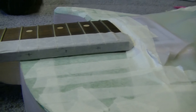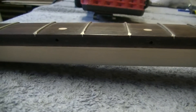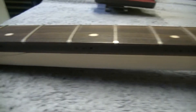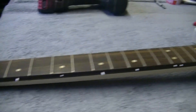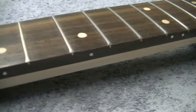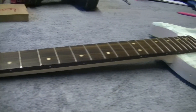I'm not going to be able to get close-ups as I'm working and drilling, so I'll bring you back when I've drilled out the holes and once I've put the dots in. Here I've already marked out where my side dots are going up the whole length of the guitar. Got the holes all drilled out, so we're ready to peel the tape — and there we have our side dots. Side dots all in, just going to let the glue set up, and then we're going to cut them off and sand them down. Sanded down to the guitar, nice and smooth.